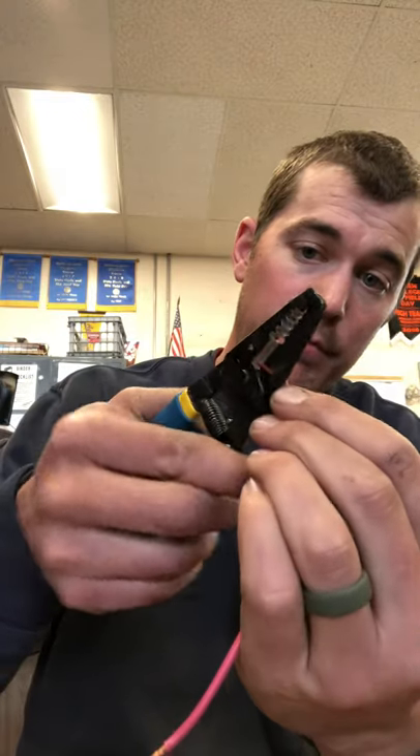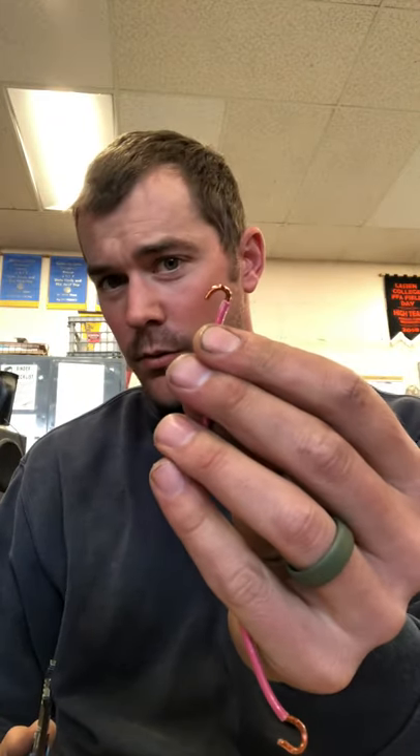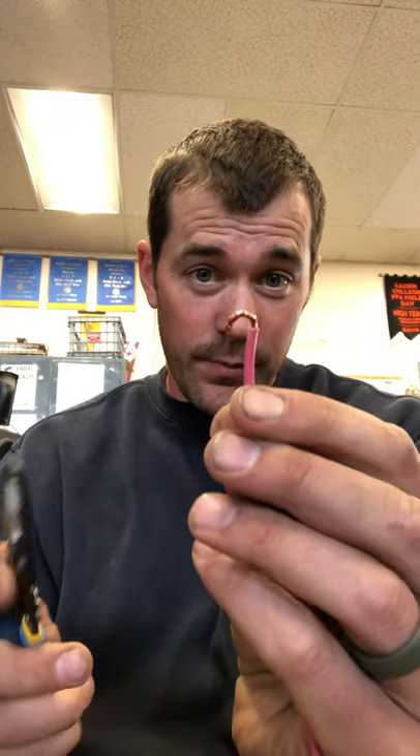So what we're using here is a 12-gauge — much like on our cable, that was a 12/2 or 12/3, the 12 meaning the gauge. For our pigtail, we're taking our 12-gauge hot wire since it's red, and using our wire stripper, bending the wire at close to a 90-degree angle. The wire stripper is then placed at the very edge of the wire and we curl back to form our question mark. This pigtail is a little too short; we want to avoid having any insulation or rubber coating trapped underneath our terminal, outlet, lamp holder, or light switch. So we'll do a simple cut and redo it.